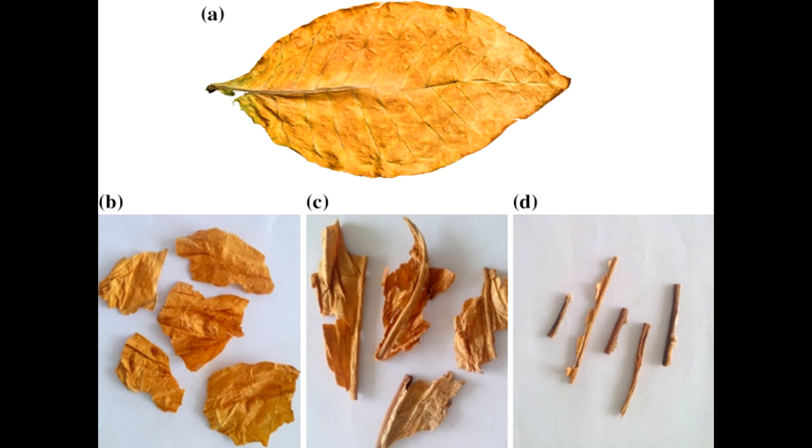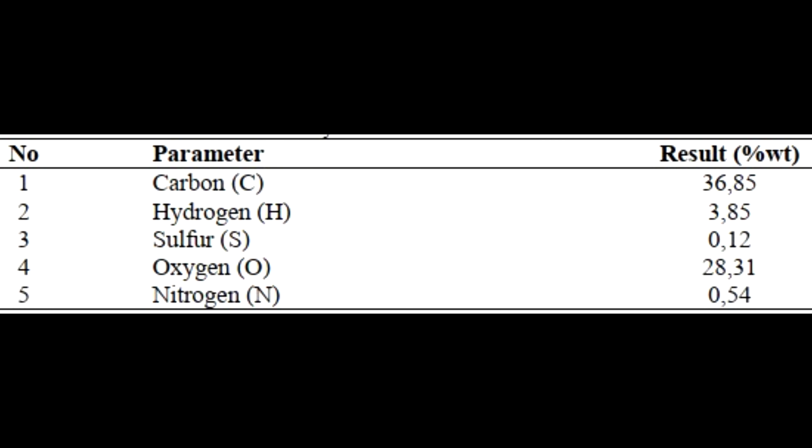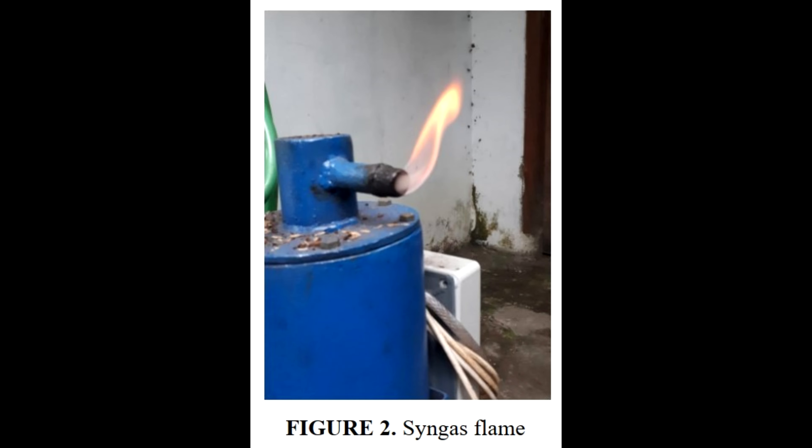On the screen you can see the moisture and chemical composition of the fuel he used. He assembled a gasifier from a small piece of 150 pipe with several tuyere belts. In his work, he directly states the same thing that I said earlier — that the amount of tar decreases. He assembled a 2 kilowatt total power gasifier which consumed 5.23 kilograms of fuel per hour.